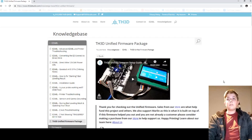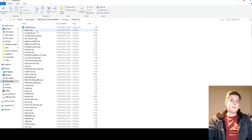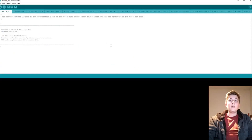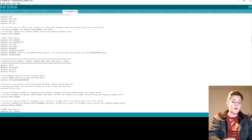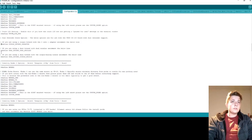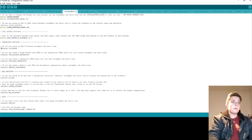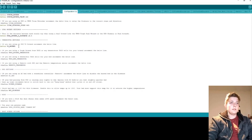I'm going to go ahead and configure the firmware. I've gone to TH3D's website and downloaded their firmware — there's an Arduino file which I'll open up. In configuration.h, since none of the listed printers match ours, I'll uncomment the CR10S since that's what the board was set up for, and select the CR10 LCD. My board has dual extruder support and I'm using a dual hotend with a single mixing nozzle, so I'll uncomment that line. I'll define the custom E-steps value to 102, which we can calibrate later when the extruder arrives. I don't have a V6 hotend, but I think the thermistor and heating element will be the same, so I'll uncomment that option now.